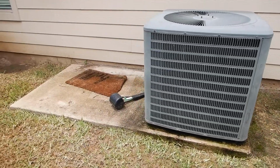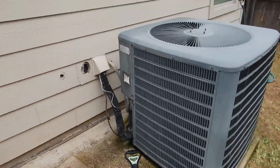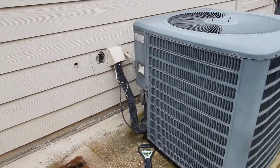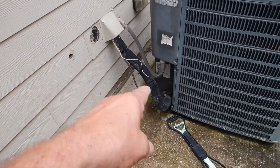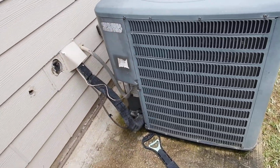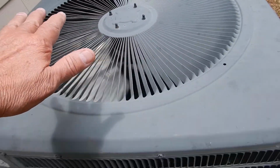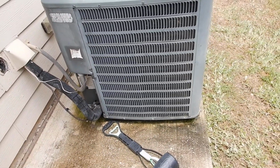On a day like today, we've got heat inside of the house. We want to extract it. So the fan drags the air over the coils inside, that piping on the wall we were looking at. Then this piping goes to those coils, and it takes the heat that it collected, comes down here and moves it through a change of state and all this stuff. And you feel your hand right here, it's warm. That's the heat coming out of the house. It's actually pumping the heat. I know, it's a little confusing.